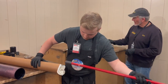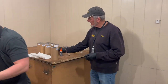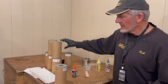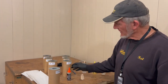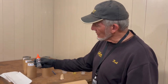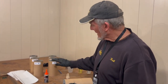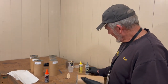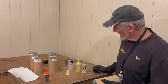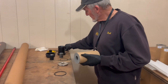This motor is similar to our O motor where we're pairing three sets of grains together, so you have essentially three pairs. When you get the motor, it will already be inhibited on the grain ends. We recommend bonding in the grains with Elmer's Glue All or Gorilla, and also mixing 30-minute epoxy and rebonding the grain ends as we insert them. Your grain set will come with O-rings, grain spacer O-rings, steel disc O-rings, and both forward and aft O-rings.